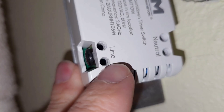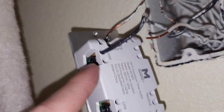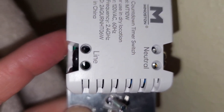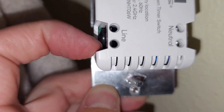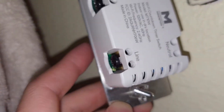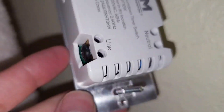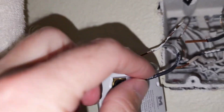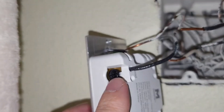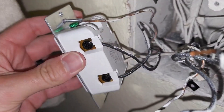There is a plate inside of here, so if you put your wire in and it just pulls right back out easily, that's what was happening to me. There's a little silver plate in there and you have to get it to be on the right side of the hole — if it's on the left side it's not going to tighten at all. You can actually hear them rattling in there, so definitely take note of that. Get them in there right and then do a test by pulling the wire out as hard as you can — it should not come out at all if you have it locked in correctly. That's how it looks right there.